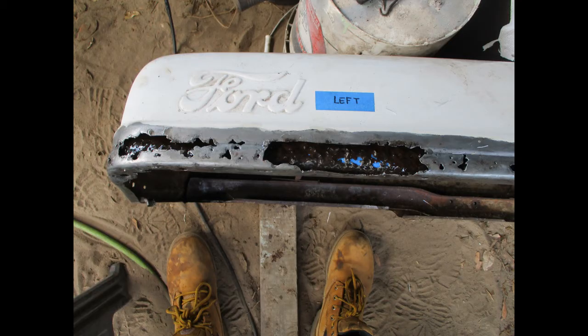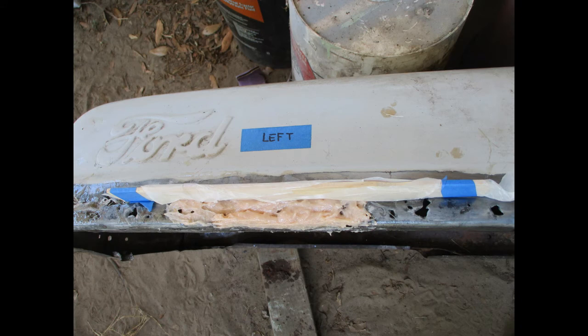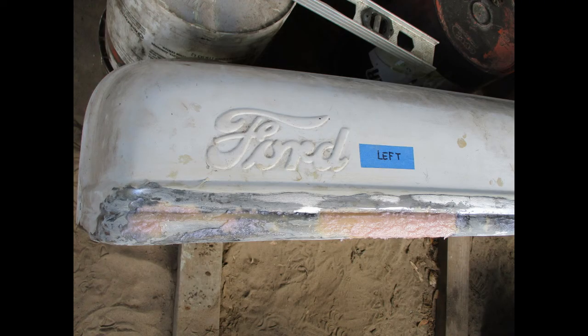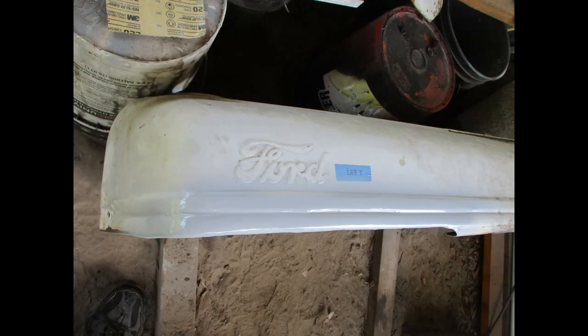The metal was coated with epoxy resin and wetted glass layered in. This is the first layer of fairing. A paint scraper covered with wax paper was used to establish the groove. This layer of fairing was completed and sanded. You'll find it's very easy to get the proper shape as you sand. And another layer of fairing and sanding. And finally some primer and paint.